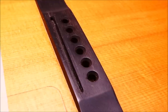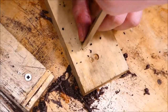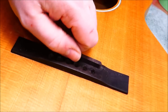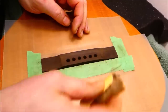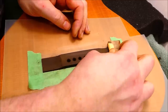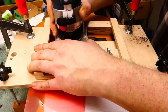So I'll get out the ebony. I'm cutting the plug to length, creating the radius on the ends starting with a chisel and then a file, working it down carefully so there's a nice snug fit. I'll glue this in, plane it off, sand the top. Here's where I'm correcting the upwards warp, trying to get rid of the undulating surface on the top and the wing. With a new saddle slot, I can get back to this setup. So we'll leave this guitar behind and get back to the Gibsons.